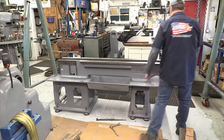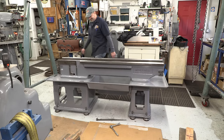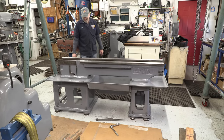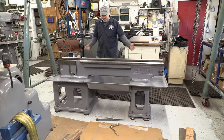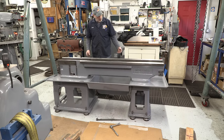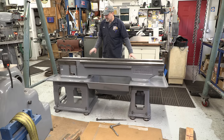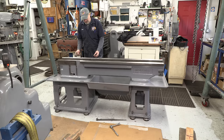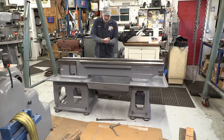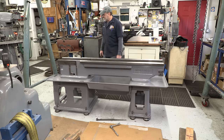That's what we've been waiting for — look at the floor space I've got now. I'll be doing some more painting, but I want to touch up on everything that's been painted. As you go in, you want to seal up some areas with paint that join things together, where you're really not painting all the areas until you have the fit, because you don't want to put unequal layers or runs that get hard in between your mating surfaces.